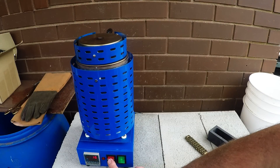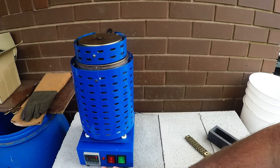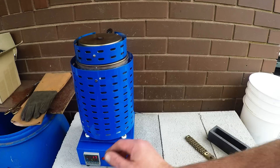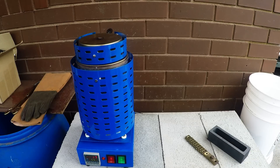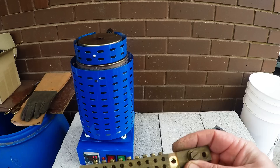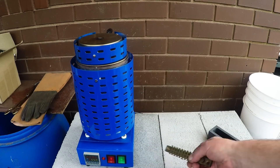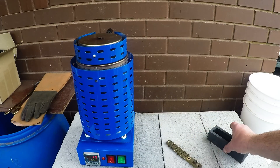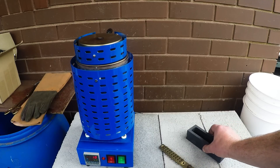We'll let that start off and start the heating process. I'll bring it up to 550 and when it stabilizes at 550 degrees Celsius I'll bring it up to probably about 1100 degrees, maybe 1120. Just to see how we go — might even do it at 1150, but I certainly don't need 1160 like last time. When the melt has started I'll warm this piece up and drop that in as well, then get everything else ready around it and see how we go.